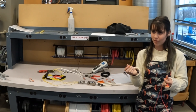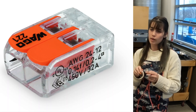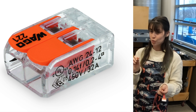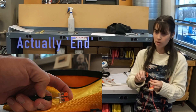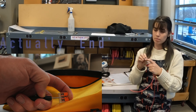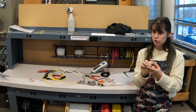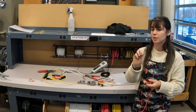What are Wagos rated for? If you look on the side of your Wago, it says right there that you can use it for 24 to 12 AWG gauge wire. They are rated up to 450 volts or 32 amps passing through safely. On the back, if you look right there in the middle, you can see that you can actually get a multimeter in there to test for power — so if you have these installed and want to check your system, that is a really great feature.